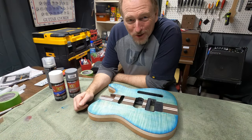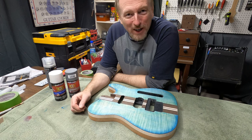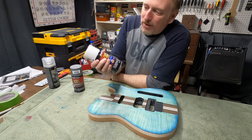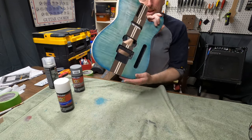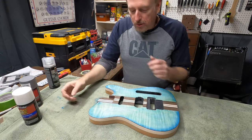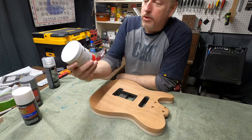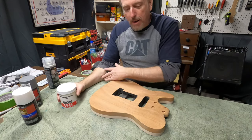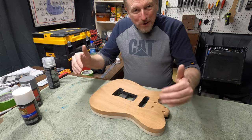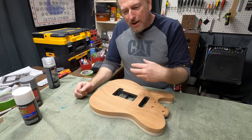When it comes to experimenting with guitars, I always experiment on one that I intend to keep myself — that way, if something doesn't go quite right, it's not going to go to a customer. So I'm going to try some Duplicolor paint on this guitar. I'm going to use a pearl on it — I'll first prime it and then paint it with the pearl on the back and on the sides. Before I do that, I'm going to use my Color Tone water-based grain filler on the back. Sometimes I like to have the mahogany show the little pock marks so you see that wood grain in there.